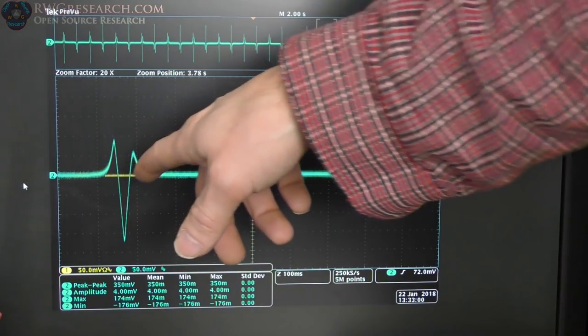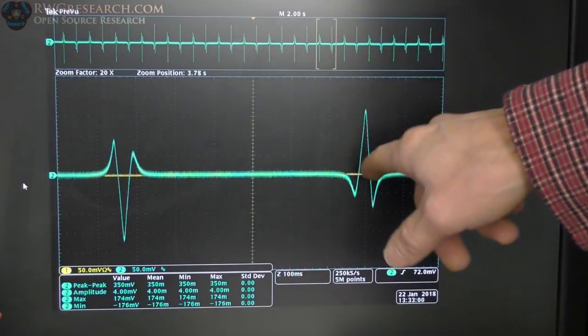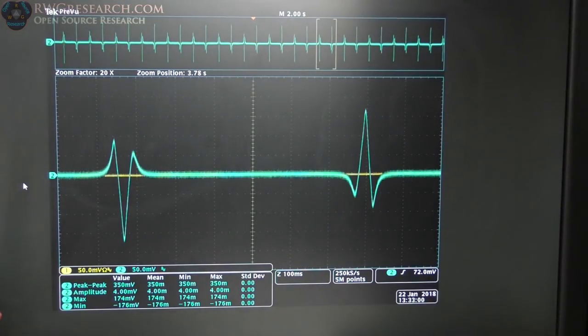Now here's the addition of the other portion you can see up here. Okay, but get that. Depending on the direction of the magnet, one way or the other, we get a totally different result when the coil is at 90 degrees from the magnet and swept across it long ways like I showed you. Again, this is all a bit counterintuitive, to me anyway. And so these are things that you really need to study. If you want to completely understand how this stuff works, you must study the interaction between these things.